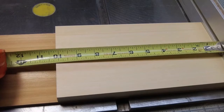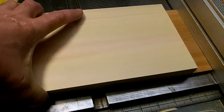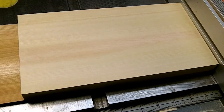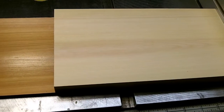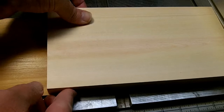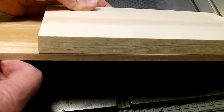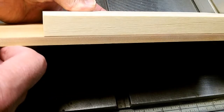I have found that over a period of time that around 10 to 12 inches is a good length to have for your slick plate. So that's the length that I make mine now. You'll also have to determine the exact length that you want your overall sluice to be, so you'll know how many of the little dowels to cut. I usually, for my recirculation, figure 22 to 24 inches long.